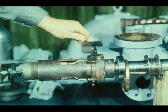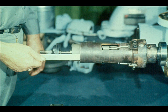This particular turbine is equipped with weight stops, which must be reinstalled on the governor case at this time. The weight stops prevent the weights from moving out too far during operation of the turbine. Now measure from the face of the adjusting nut to the end of the governor case to make sure that the adjusting nut is back in its original position — the measurement should be the same as the one taken before disassembly. Check the position of the weights during this procedure to be sure they are not binding.